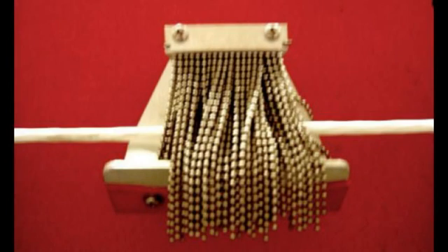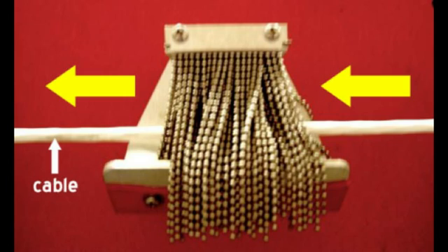Once the cable is cooled, it is then dried and tested for defects with the spark tester. This type of spark tester has small beads which are electrified and will detect any holes or non-coverage in the jacket. If a defect is detected, a spark will occur and leave a mark on the insulation or jacket material. The defect will then later be removed.